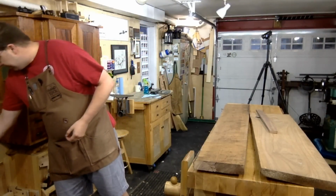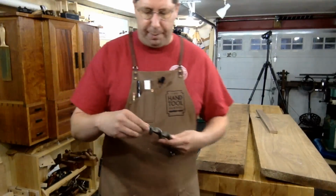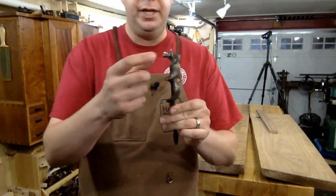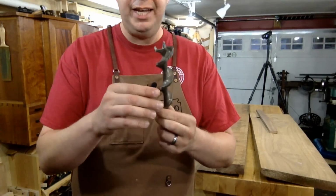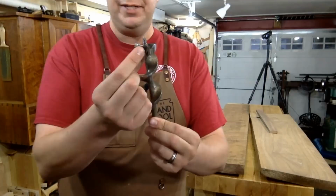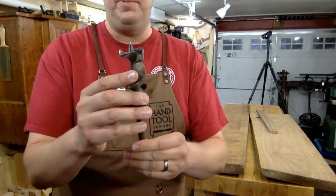They're really not. The auger bit, the traditional auger bit, has a very specific job. The lead screw certainly is pitched appropriately for the wood you're working on. It's pulling the wood in. So these lips right here are doing all the cutting. The spurs are scoring the perimeter of the hole.